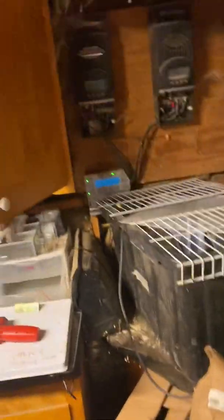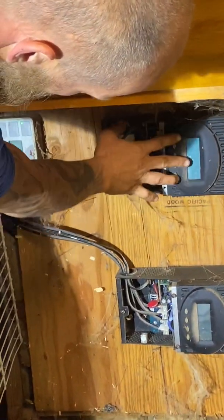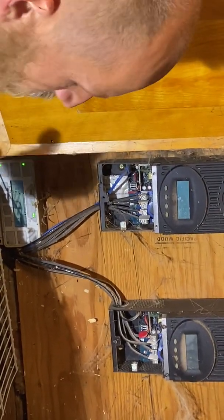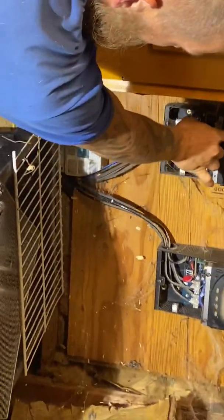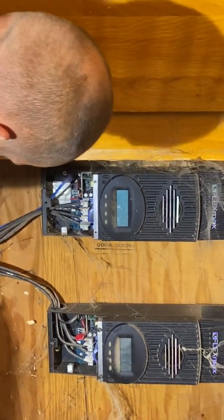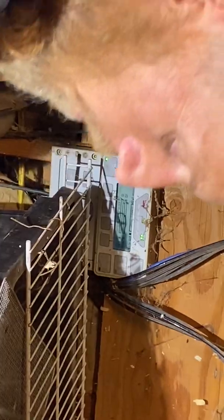This is our solar controllers — the solar controllers are currently off. We're coming in from the solar panels into these controllers. The way I have it set up they're coming in at about 70 volts; this drops it down to 48 volts and then sends it into the inverter and everything. When they're on I can monitor and track how much power I have coming in. This is the brain box of the system — it just tells me what all my voltages are running at, how much power is getting used, all that kind of thing.